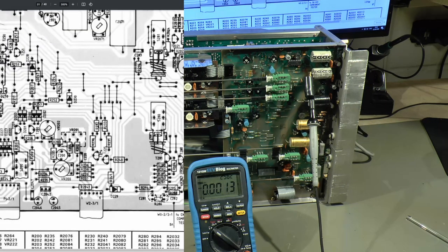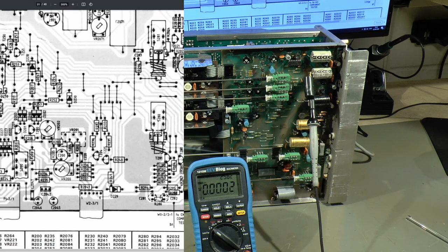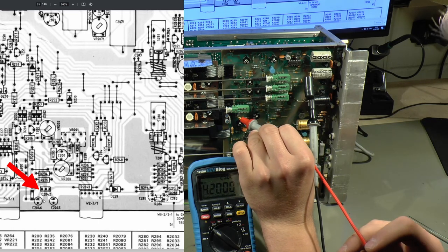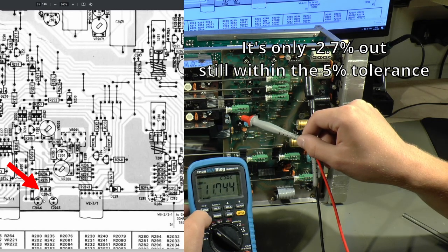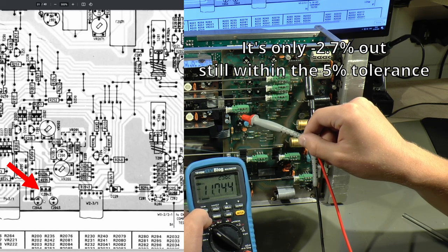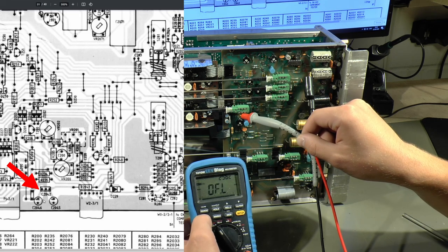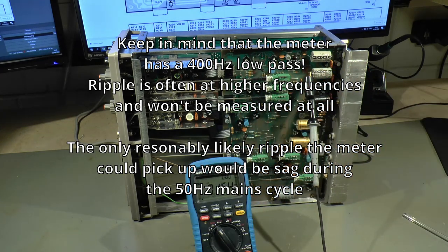The bottom one has 260 volts and the top one 139 volts. Looking at the schematic, these capacitors are connected somewhere across this rail, and having 260V and 140V on there makes me think this is actually fine. There's one regulator we haven't tested — the plus 12 volt one — which is hiding down at IC2042 rather than up near the power transistors. Carefully measuring that shows it's at 11.744V — not great, as I'd expect such a regulator to be quite accurate, but these things are 40 years old, so maybe it drifted. The ripple certainly isn't bad enough to cause the problems we've been seeing.